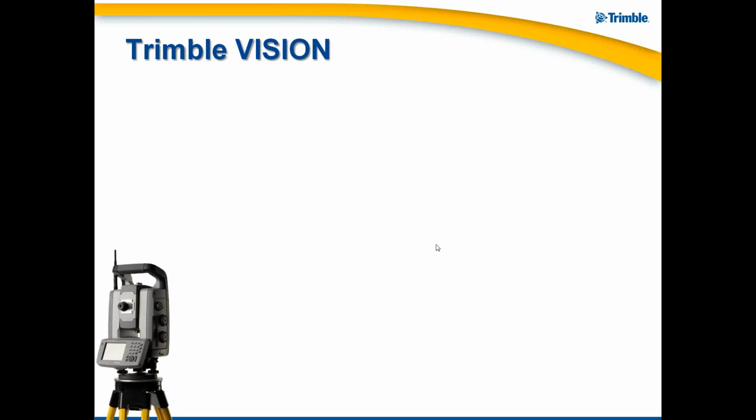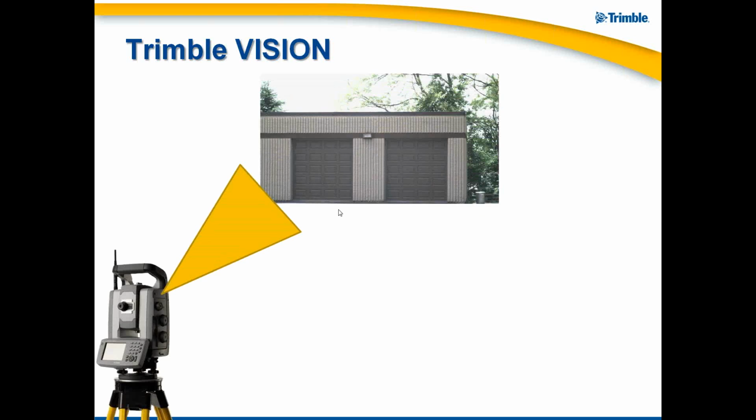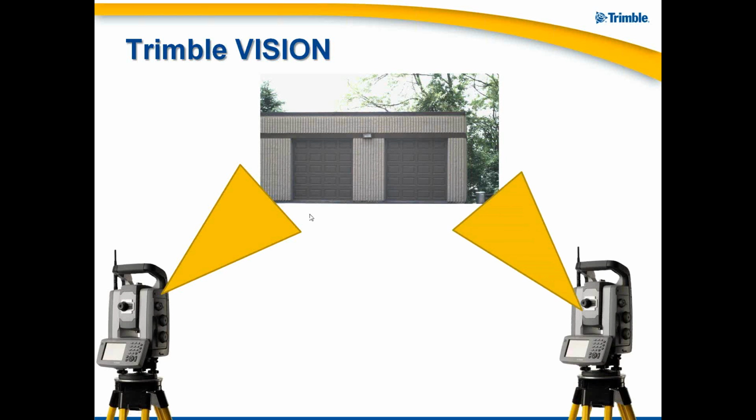So the workflow robotically would be to be on a known control point, take a photo of a building or an image that we want to actually create points on. We're going to want to do it from at least 2 setups. So now we can bring this information into Trimble Business Center and you can kind of triangulate a position based off of the photos.